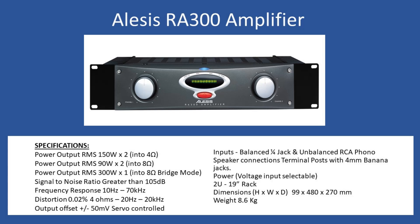This amplifier is no longer available but they were sold in good numbers and they probably appear in the workshop on quite a regular basis. Overall construction and build quality is good — nice steel construction, limited use of plastic apart from the front fascia and your connections on the rear. In terms of general specifications, power output RMS is 150 watts per channel with a 4 ohm speaker load, reducing to 90 watts per channel with 8 ohm speakers. If you turn the amplifier around you'll see there is a switch to select between stereo mode and bridge.